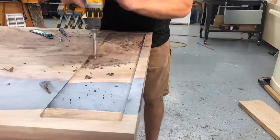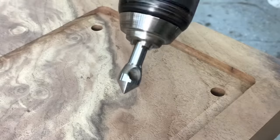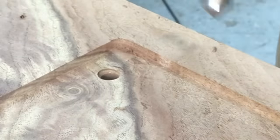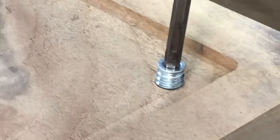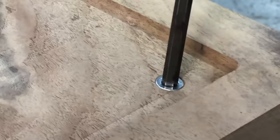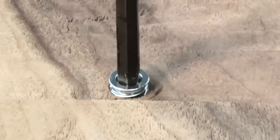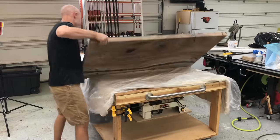I realize I am rushing this table leg installation a little bit, but the good news is I have a full video and a step-by-step blog on how to install table legs properly. You need to allow for wood movement, and that is what these threaded inserts allow for, as well as enabling the table to be assembled and disassembled an infinite number of times. Whereas if you use just lag bolts, you could really start to auger out that hole after taking it apart just a couple of times.